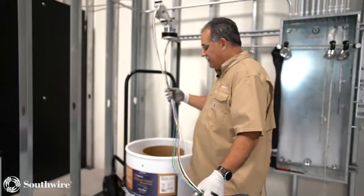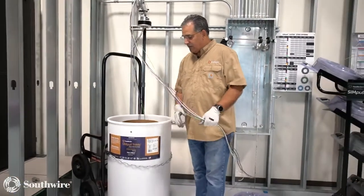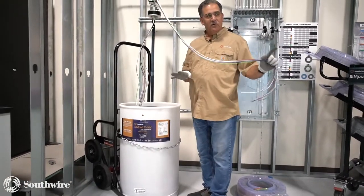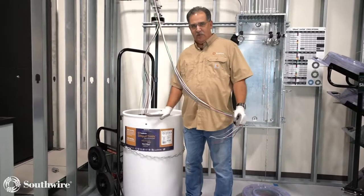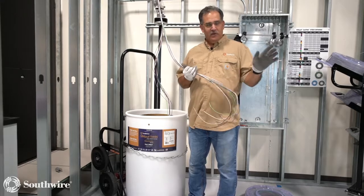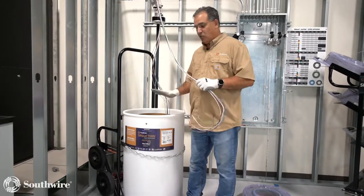The nice thing about this is that it's a 7 conductor barrel with pretty much 3,000 feet of color. If you do the math, if I was doing reels, that would be 14 reels of cable that I have capacity for in this barrel. That would be 14 reels I would have to set up on a reel stand versus 1 package moving.